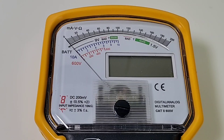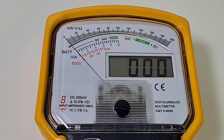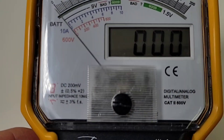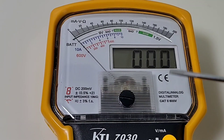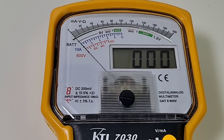Let's turn on the meter — and there we go, there is our verbose display. By default it is in AC volts. However you have that yellow switch pressed or depressed determines whether you're in AC or DC. I just pressed it, now we are in DC volts. Not too shabby — it's low resolution obviously, but I like the fact that they've put the digital display not right in the middle but more to the side of the overall display, so it's really easy on the eyes and doesn't get in the way of the analog display on top.